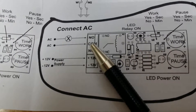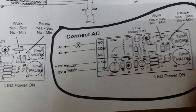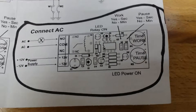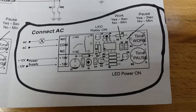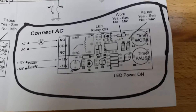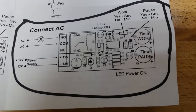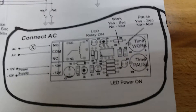One of the connections from the circuit goes to the brass screw on the receptacle. The other wires on the extension cord go directly to the back of the receptacle — the white neutral goes to the other side, and the green ground goes to the ground on the receptacle. It's real simple to hook up.